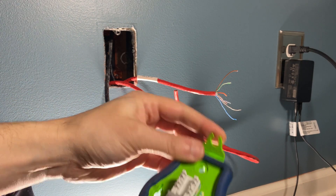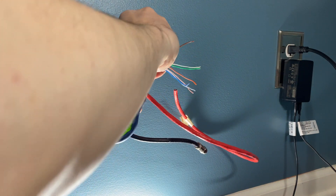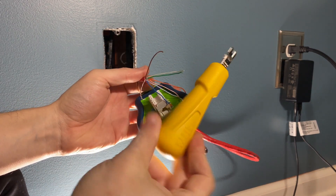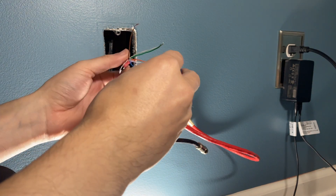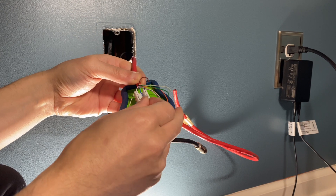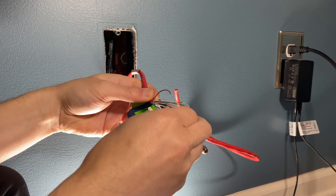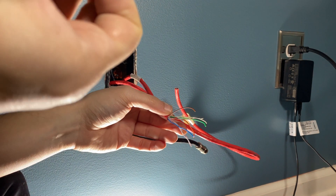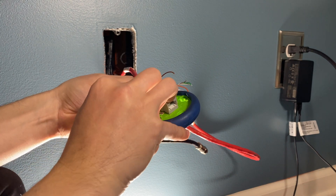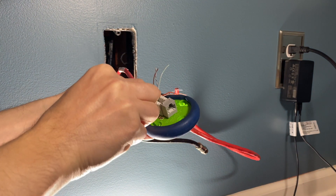The tool also has a little cable holder, so when you're doing this you can just clip it onto the cable. The punch-down tool is what you'll need to terminate the conductors. I like to get everything lined up and start from the bottom up, starting on the left-hand side. Blue and green look very similar here, so we're going to start with blue — just tuck that in there. Then green, just tuck that in there.